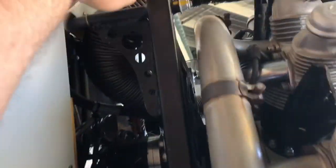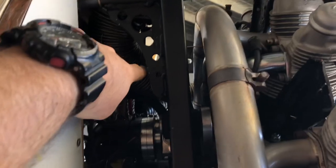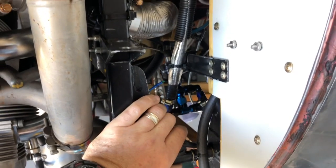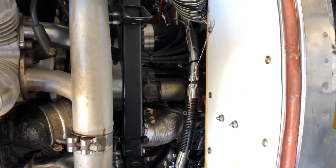The trouble with these things is air cooling. We're getting vapor lock and heat soak into the back parts, where all the important parts are, like your carburetor, fuel lines and oil pump. So we've got ducting here, as well as another one on the other side, so we're getting direct cold air into the back. We've also been playing around with the fuel mixture to make it a little bit richer, and with the fuel manifold as well, just to get non-vaporized fuel into the back. But the big thing we've noticed is this volume of air that we want to get through there.